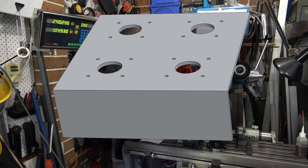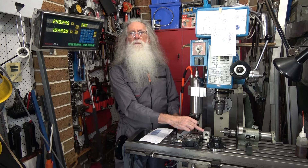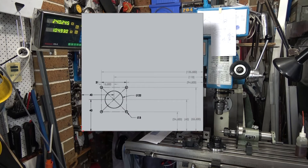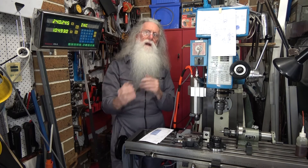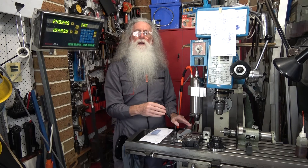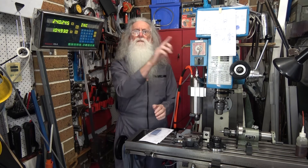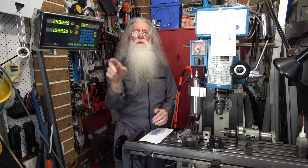For example, I'll show this image of four stepper motor mounting plates. The four groups of holes are the same. With a CNC machine, it will set up the datum and always go from there, so all your measurements are from there. I'm just talking about the readouts — not whether you're on incremental mode or absolute, just where it's taken from. So if you're looking at your G-code, it will be 50mm to there, 75mm from there, 26mm from there.